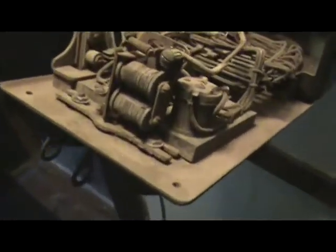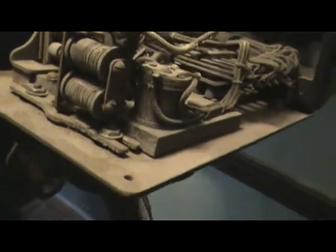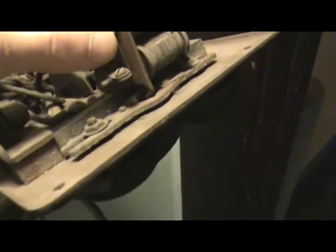When I looked at the bells on the bell mechanism — the interrupter mechanism — I saw that it looked complete and that the coils were in good shape, so I tested it with a 9-volt battery and it didn't work. But then I cleaned up the contacts over here — there's the interrupter contact, which was dirty — and I put a little oil on the pivot points where this actually moves. I also adjusted these bells to spread them out a little bit so the clapper had more room to travel between them. It was really muffled the first time, and when I spread the bells out it became a little louder.